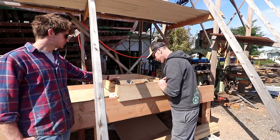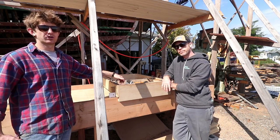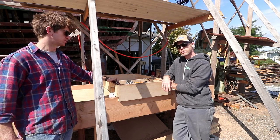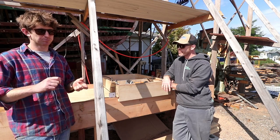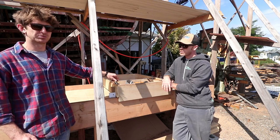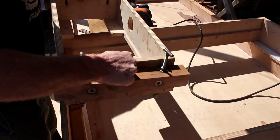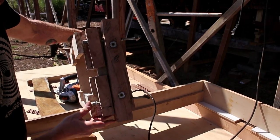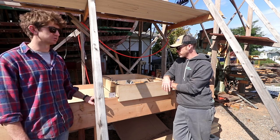And then with the lift system, we did originally have a way to lock that system off. So another set of thumb screws, essentially, which would lock the lift system in place. But we eventually found that it was taking too much time, and the top screws were still vibrating loose. So we added nylock nuts to the main lift screws, and then we were able to completely get rid of the locking screws. So that makes it a lot faster to adjust the height between passes.